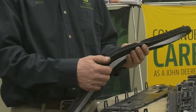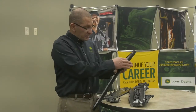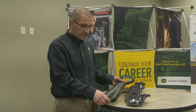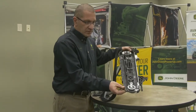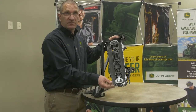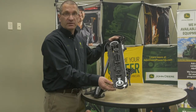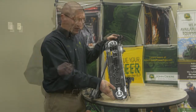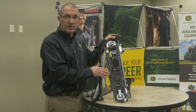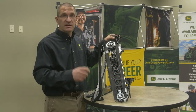This is your brush belt — literally a brush. As the seed gets put in, it comes around and when it opens up, that's where it transitions the seed to drop. There is a small scraper underneath that runs on the brush — make sure that's in place, as it will scrape off any corn stalks or dirt debris before going back up into the brush. If you run in wet conditions, take this apart and check for mud in the brush belt unit so you don't wear out your brush and can maintain constant seed drop.